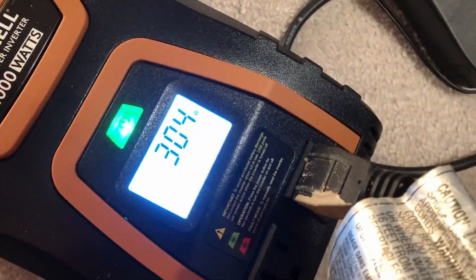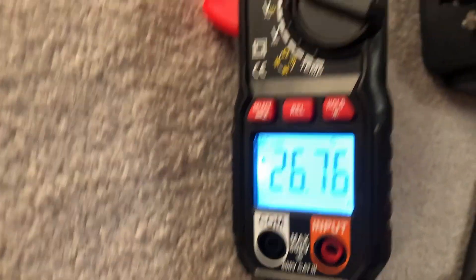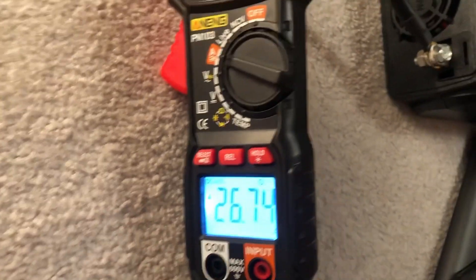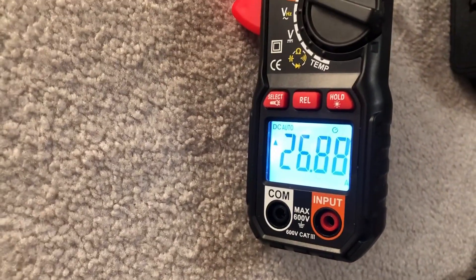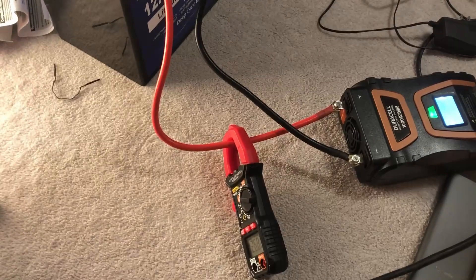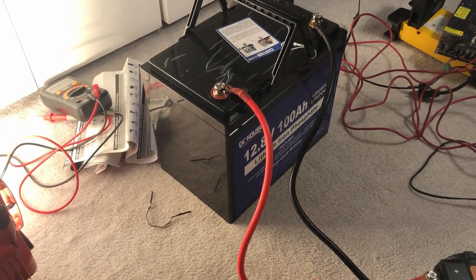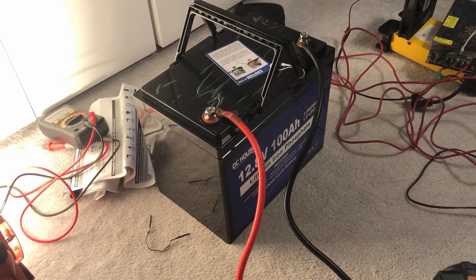As we sit now, we are going to be 304 watts off the battery running, and we are pulling 26.8 amps. We are currently at 6:06. I'll average this out at around 26.8 to 26.9 amps and check it multiple times throughout the test. At this rate we should be good for just shy of four hours, which will give us a full run time on this.